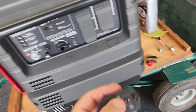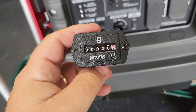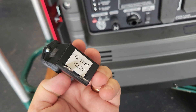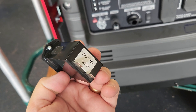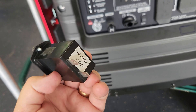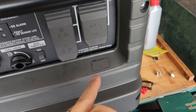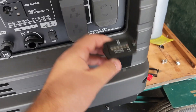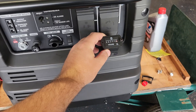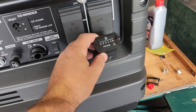The plan is to use this old-school analog hour meter. This particular one runs on 110V AC — you can get them that run on DC or AC. We're going to put in the one that runs on alternating current and stick it right here where this rectangle is drawn, so as you approach the generator controls it'll be visible right there.